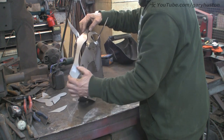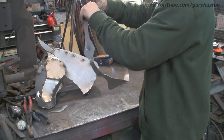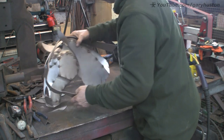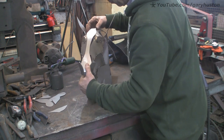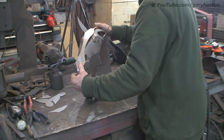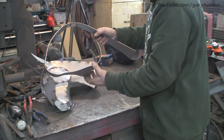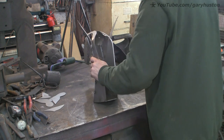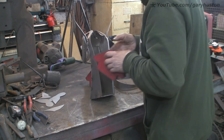But as I say, trying to hold the damn thing still on the bench and try your pieces on is quite tricky. It might even pay to put a little tack on it and tack it to the bench, but then of course you're bound to want to look at the bit somewhere you can't see and you're going to have to untack it again. Anyway, you can get the idea of what I'm doing - I'm sort of trying to get a reference as to where it's got to bend, and literally doing it by hand. And if I can use these couple of magnets to keep it sort of still and start tacking...